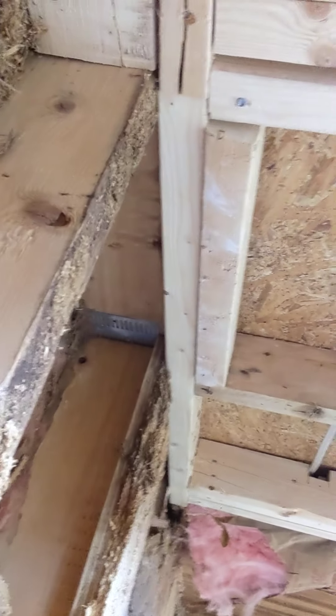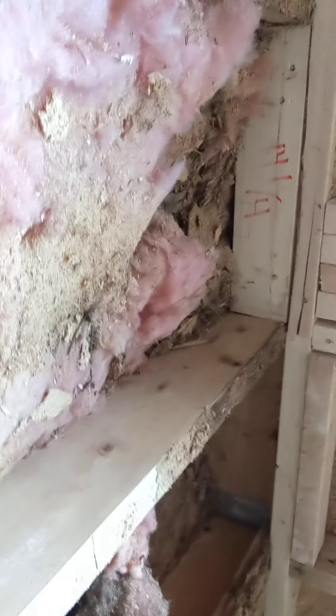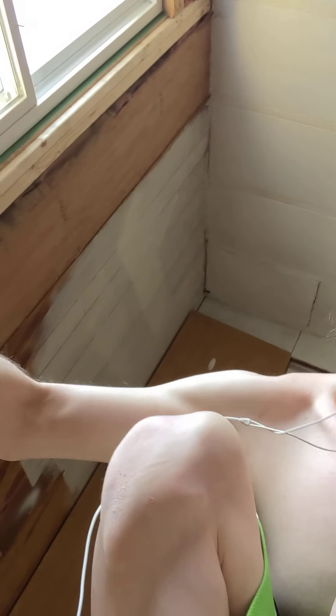What you have is the floor actually goes in underneath, and then they build the wall on top of it. What we're doing is boxing them out. As you can see here it's 14 and a quarter inches — each one is just a start. I still have to go back with another two-by-four and build it out, so it will eventually look like this.